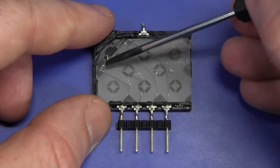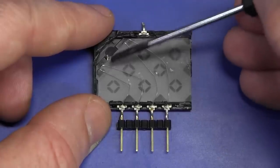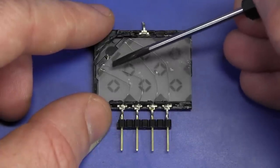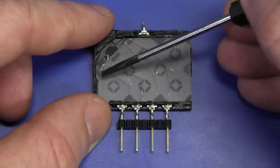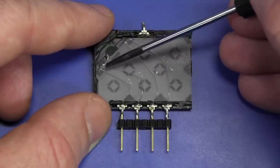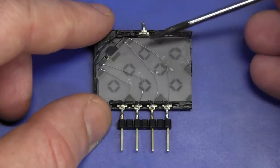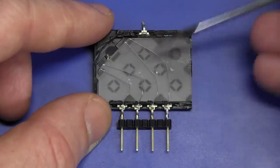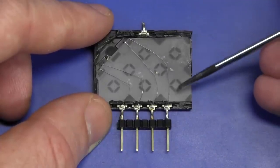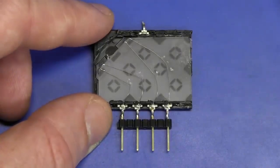What makes this thing directional and allows the wave to travel this complex path is not only the thickness of the glass — which is nominally one wavelength — but the aperture as well, which is the width of the path. That is typically much larger, as you can see, than the thickness of the glass. So that allows the wave to be directional, and the physical properties allow the wave to make that entire distance without dispersing too much, helped by these epoxy dampener materials which keep it channeled and stop coupling between the paths.